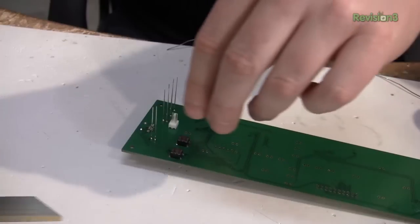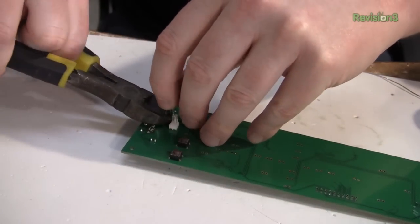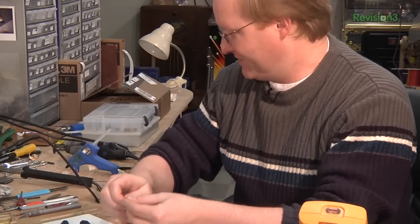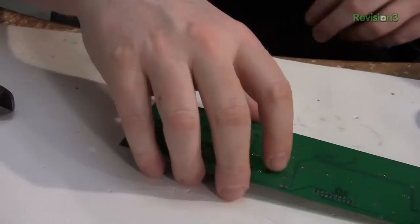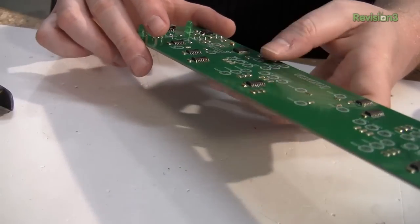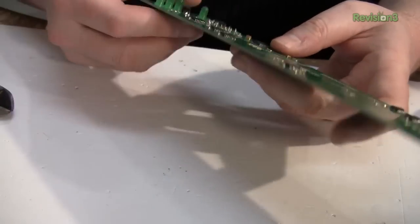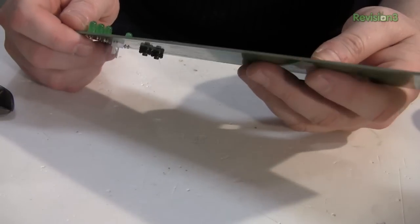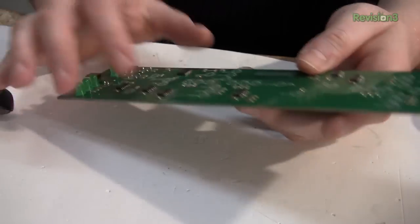These ground pins require a lot more heat and we're not in the oven anymore. Here's another big advantage to surface mount: not having to cut leads. I always save these leads for prototyping, but imagine if all these resistors and capacitors had two leads each — that's a lot of manual snipping, a lot of waste, and a lot of time. So that's another advantage of surface mount: no leads.